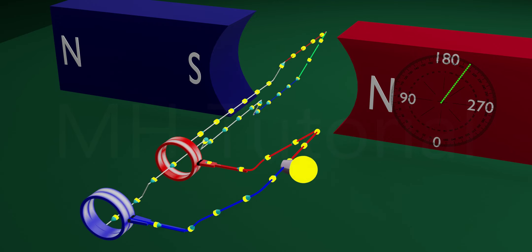The brushes are placed very strategically: when the commutators rotate, each brush remains in contact with one and only one commutator at a time — there should be no chance for a brush to touch both commutators simultaneously. To show the output current, a bulb is placed and each end of the brushes is connected to it. If the armature rotates, a current will be induced in it; this current flows from red arm to red commutator, then red brush to the bulb, to blue brush, to blue commutator, to blue arm.